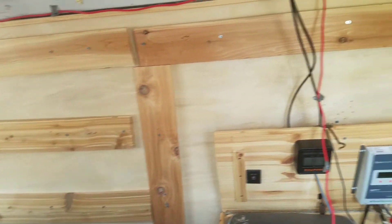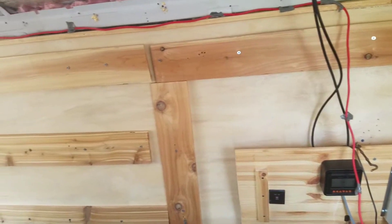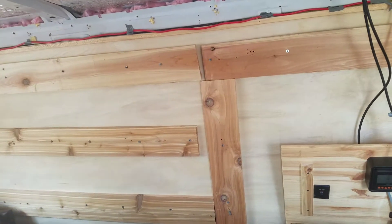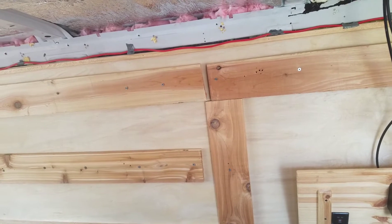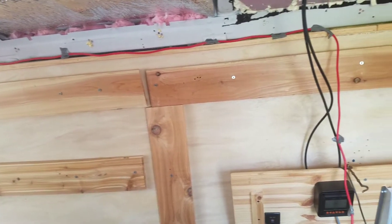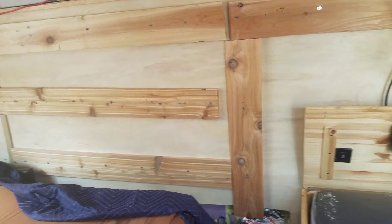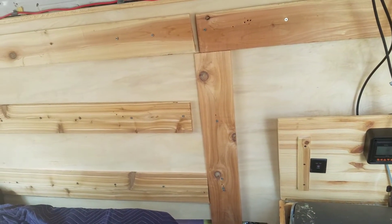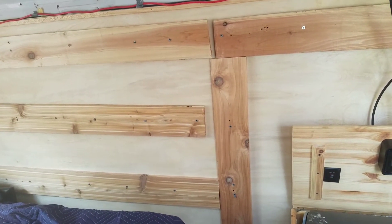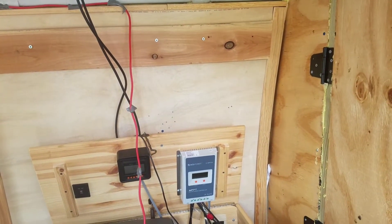What I did do — you see these boards lined up along here? I told you on the opposite wall from the door, I made a mistake. I used 1x2s, in other words very thin small pieces of board, to hold up the paneling and that was not going to work correctly. So what I did to correct that was I got some 1x6s and drove the screws all the way through the 1x6s and into the 1x2s, so I have two levels of support now and I have something I can actually build on — something that's not too weak and broken down.